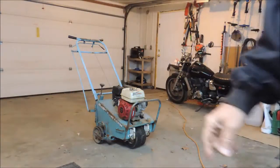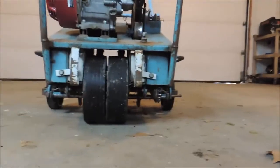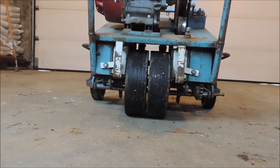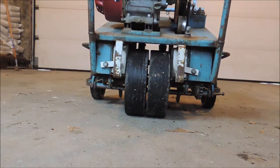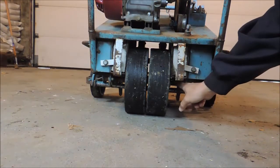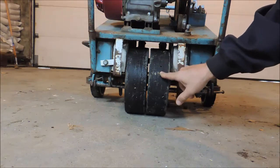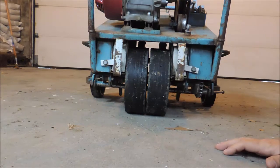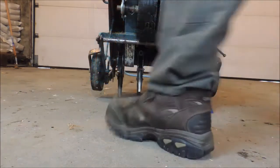So the axle, I don't know what's going to be a good angle, guys. Just trying to work on equipment. It's the beginning of the season. Stuff like this happens. Things go wrong. So the drive chain's turning, which turns the axle, so there's something between the wheel and the axle. That's where the issue is. So I've got to see if there's a way to turn this thing. There we go.